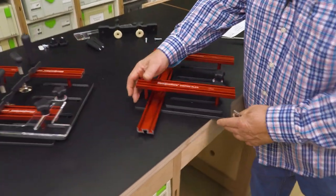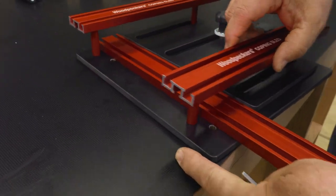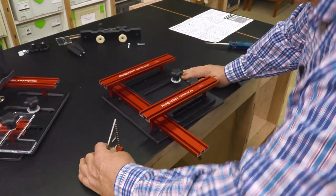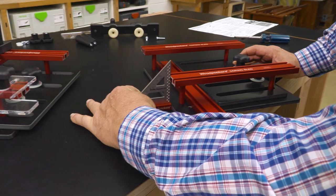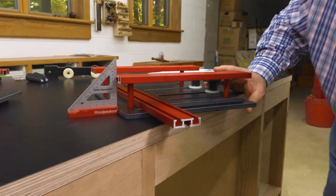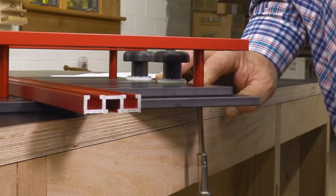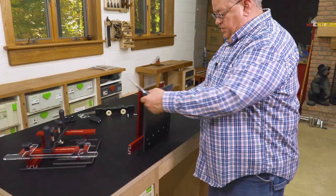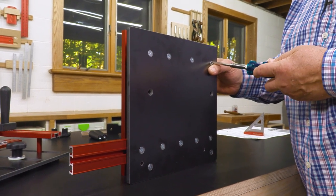Let me give you a little trick that's not in the instruction manual. We want our top tracks square to the base. The problem is the fasteners are underneath. I discovered that if I slide one of those off the edge of the table and bring a square to the back edge, I can get my alignment right there, and then I can come in from underneath and tighten the screw. Once you get one started, the rest is easy - just stand it up on end and the other side will be perfectly squared up too. Then go ahead and tighten all four of those bolts.